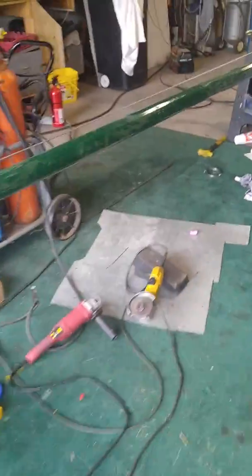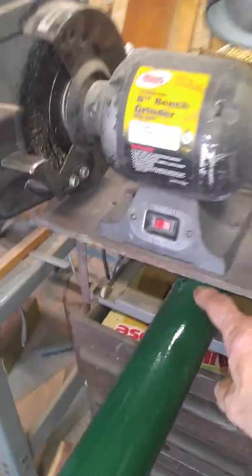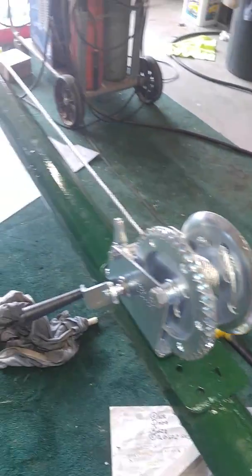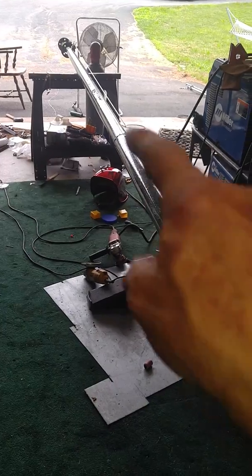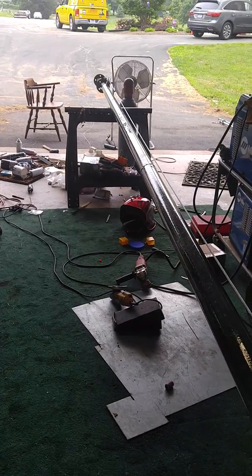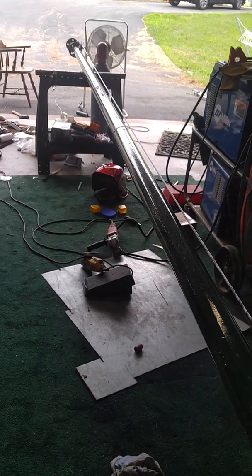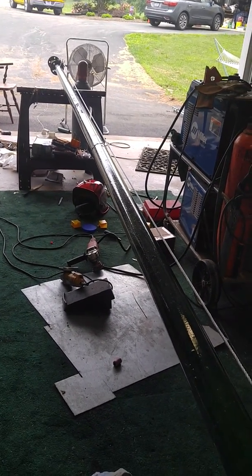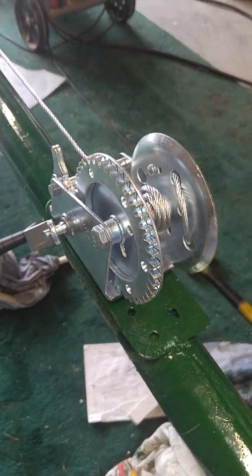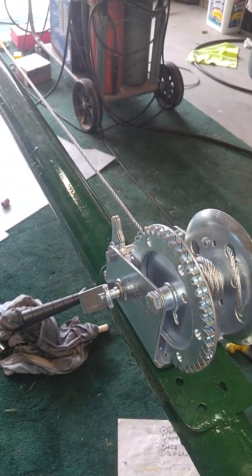We're all tickled with this. It's going to be put together, and what I'm going to do is I have a tilt-over-mast base, and the base is going to clamp onto here. Then I'll walk this thing up, and after I walk it up, I'll secure it. I've got to do the trigonometry to figure out how much each of the guy ropes is going to be. I'll get all the guy ropes cut pre-installation and tie them onto those discs, which I got at the ham fest. That'll give me the guy supports ready-made so I can put this up on a calm day, get it anchored down at the base, and then secure it. Then I'll crank it up to its full height of 50 feet.